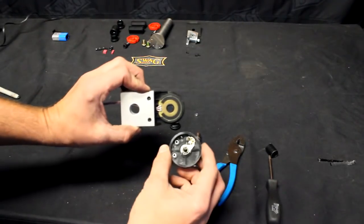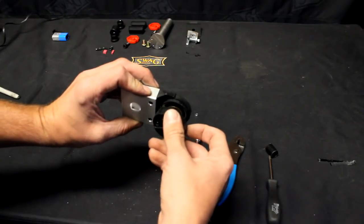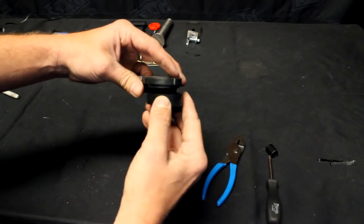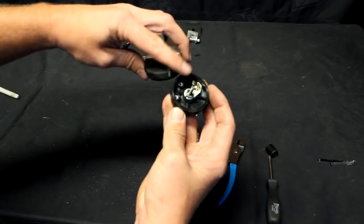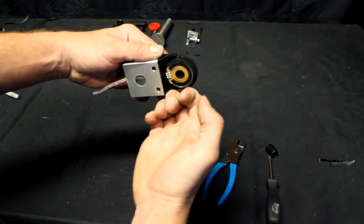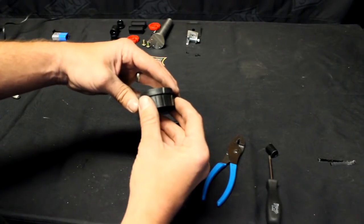This is the heart and soul of the system right there. These spring-loaded fingers ride up and down on the circuit board. The reason why you mark the start or zero location is so that you know where zero-zero is. You never want to take this thing and go backwards — what happens is these spring-loaded fingers will ride backwards over these contact points, the fingers will hit the contacts, they'll bend and you won't get any readout, which is why you never want to go more than negative 15 degrees.